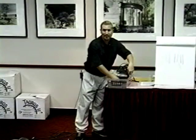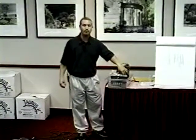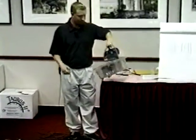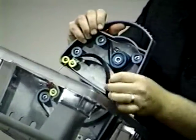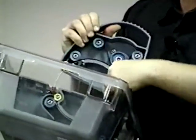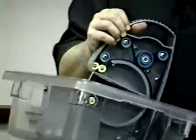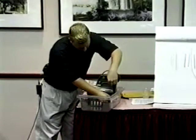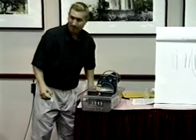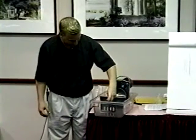When you wrap the belt around the ring, keep it loose around the ring because you want to make sure that the blade is going to be centered in that little groove. You see that groove that's in there? Make sure the blade is centered in that groove. If you shove it off to the inside, you won't see it, but you're going to flip that switch and the saw is not going to move because it's not aligned. So wrap it loosely around the raceway. Now I'm going to have to pass out my screwdriver again because we're going to take off that bottom blue pulley just like we did the top.